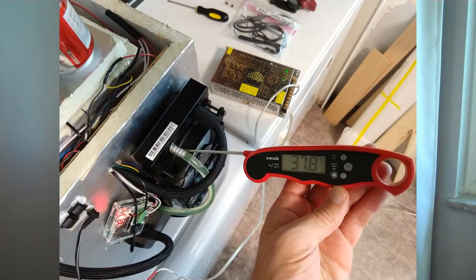I tried running the radiator fans at 6 volts instead of 12 volts — it makes them nice and quiet. Unfortunately, it really reduces the airflow, and even with two TECs running, it was heating the hot side loop 5 to 10 degrees above ambient and reducing the cooling I could get. You really do have to run those fans near 12 volts. You might be able to go down to 10 or 8 volts and make them a little quieter, but putting both fans in series at 6 volts was not enough airflow.